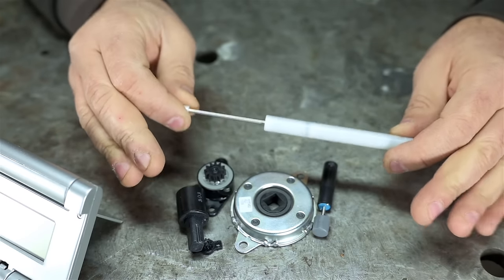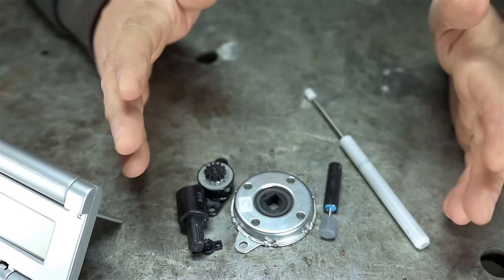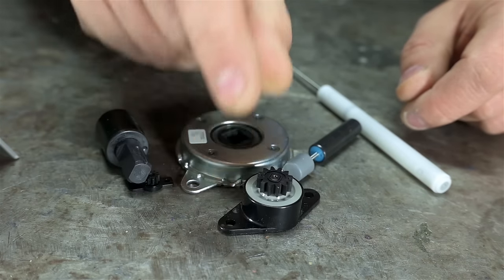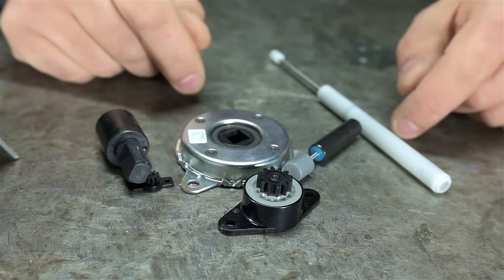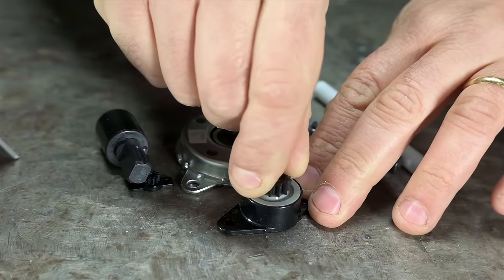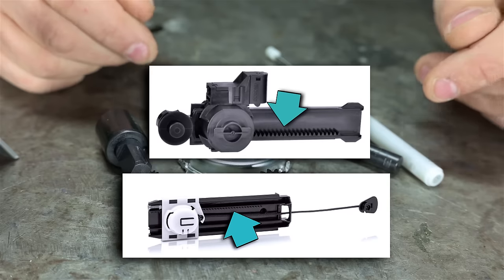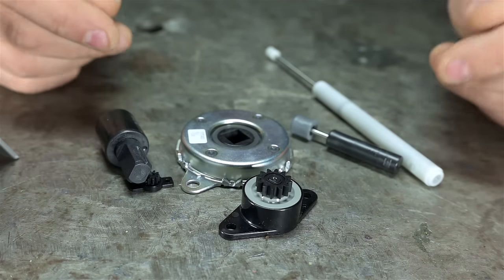The fact that they're slowing down movement makes them dampers. Now, if you want to get technical, linear dampers and shock absorbers aren't exactly the same thing — I'll leave that as today's homework assignment. Which brings us to rotary dampers. Same thing, but packaged differently so they work rotationally instead of linearly. These will damp linear motion, and these will damp rotary motion. Though the lines can blur here a bit, as some linear dampers are just rotary dampers on a rack and pinion — rotary dampers packaged differently, giving you linear motion out of a rotary damper. Which you use probably depends a lot on what you're trying to do.